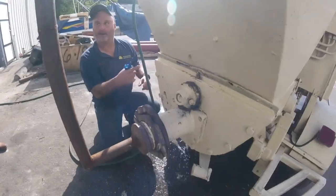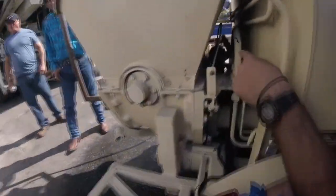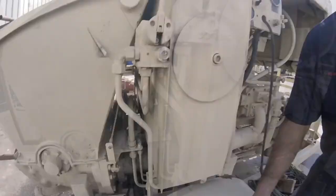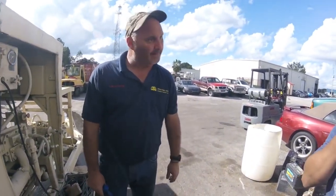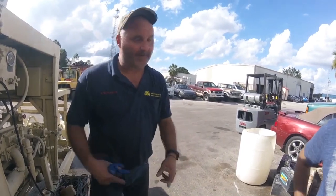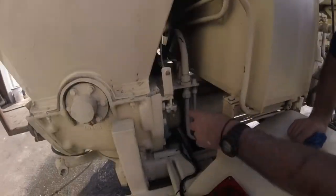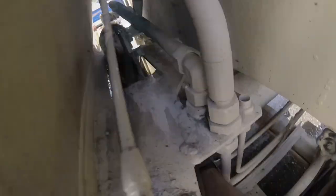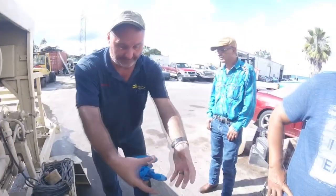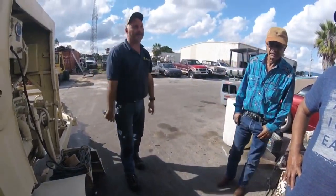Then you've got the rock valve with the cutting ring, compression seal, and the wear ring. There's one retaining with a flapper, a key stop, to call it. You take that off and then the dowel pin will come right out. At the bottom of that shaft here is a bolt. See where my finger is? You take that off and that shift lever will come all the way off. Now you can take the rock out.